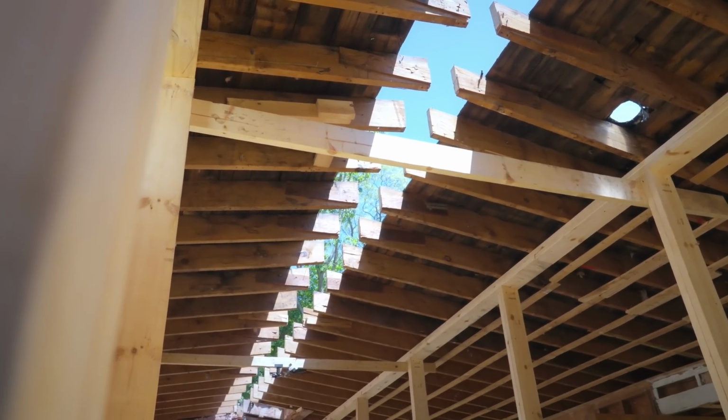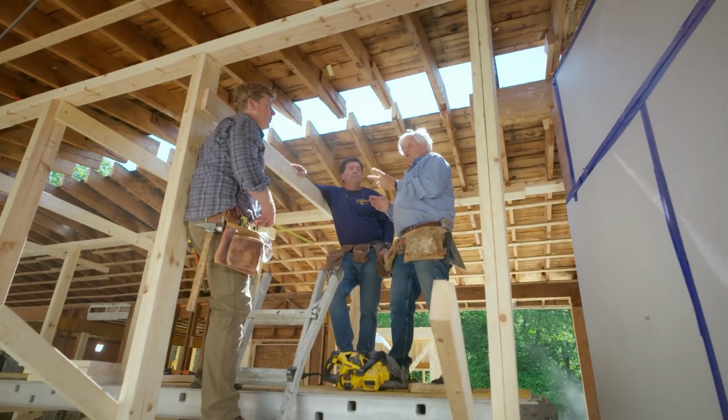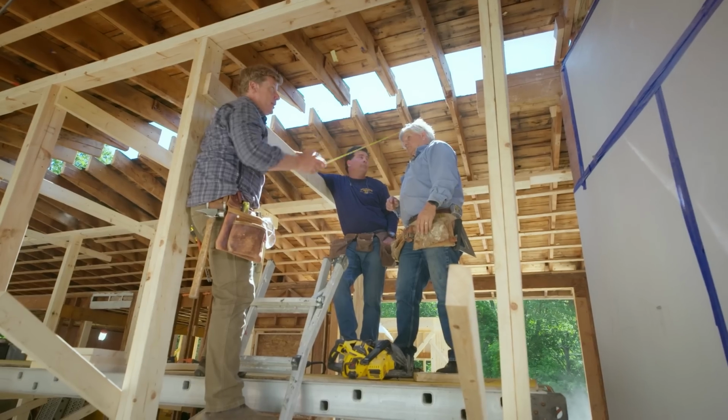Yeah, I mean, typically you try to put a beam in from down below, but almost 46 feet and 3 of them, about 460 pounds each. We're going to actually drop it in from the top because you can't get 46 feet in here. And number two, it's very heavy. Yeah. And to split the load in thirds, we're going to do it in 3 separate pieces. So one end rests on that brick wall, the other one I presume is right there, so you got a little nub that's got to come out? Yeah, we got to cut this out.